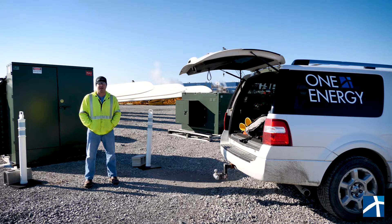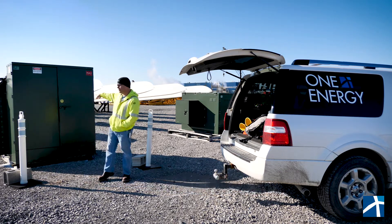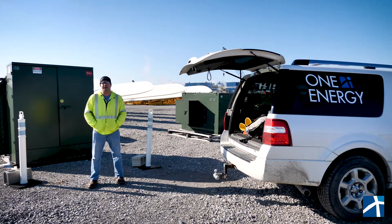Most transformers that you've seen, like this one behind here, are designed to never really be switched much in their life — they get turned on once and they don't really turn off and on. In power generation, in renewables and building wind turbines and most things like that, oftentimes we're turning transformers off and on for maintenance and other activities. The ones at the plant still occasionally get turned off and on too. What people don't understand is that turning those transformers off and on is a major safety endeavor and a high risk activity.